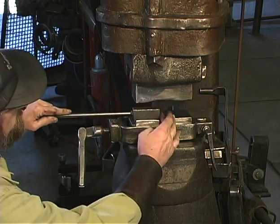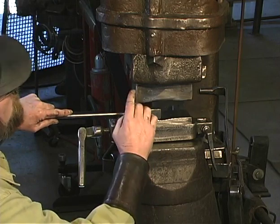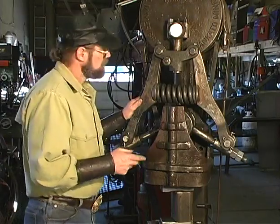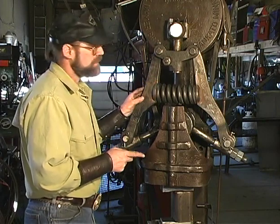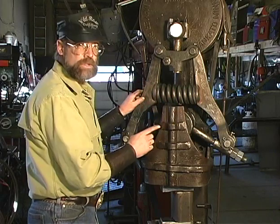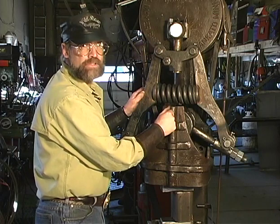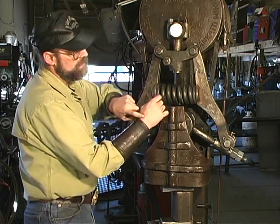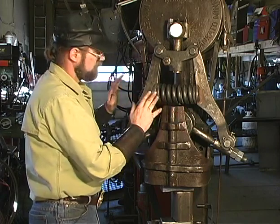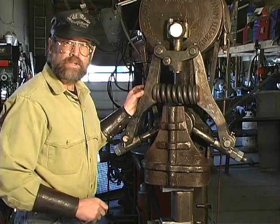If the hammer strikes with the crank pin at 6 o'clock, even though the blow feels hard and solid, it's not as effective because it's of shorter duration — the accelerating crank pin will immediately violently jerk the hammer up away from the work. If the spring is too weak, the timing will also be altered. Worse than that, a dangerous situation exists. The spring may be forced to repeatedly compress beyond its safe working limit and could fail. Even worse, the spring may not be strong enough to stop the upward motion of the ram before it collides with the spring. Exploding springs are extremely dangerous — I had one where a sliver went in the back of my hand and came out the other side. Put a guard on your hammer and be very careful that the ram can never strike the spring. Wearing pieces of your power hammer in your body will not improve your bottom line.